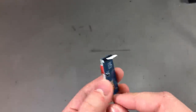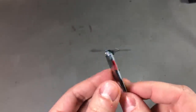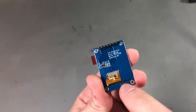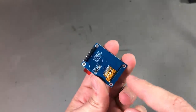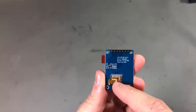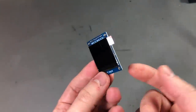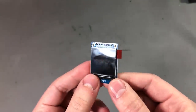I'm gonna abandon the demo for this display. Unfortunately, using it in a project is not really recommended with this breakout board either. You do have all 12 pins on the ribbon so you could break out the missing signals, but why didn't they just break out all 12 connections to a pin header? There's plenty of room on this PCB to do that — it would have been really easy.